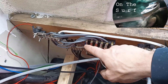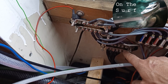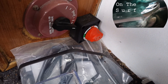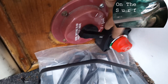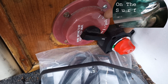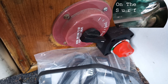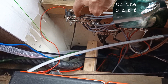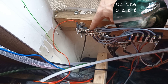Now the tricky part. Here I have some fuses, some terminals, bus bars, and down here one more bus bar. As you can see, I have two main switches. This big one runs almost everything — it lets us switch from the house bank to the starter and hook them up together. This second one I've added just for the on/off function, and it's because of this: here at the top I have the things I want to always have power on.